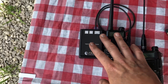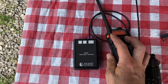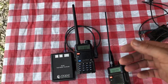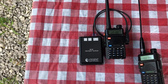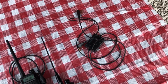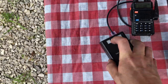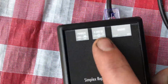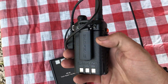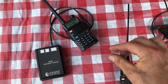Now to power all this — this antenna is coming off, this battery is coming out, and I have two battery replacers. I decided not to do the duplex repeater and just play with it, though it's kind of a pain and somewhat useless for my need. In a SHTF scenario of course it would be awesome to have, so I'm not going to throw it in the trash. I'm going to have a power supply right here that takes four through 28 volts, so it'll be 12 volts. The battery replacers take the battery out and a thing that looks just like a battery slides in, but it has wires coming out that you hook to 12 volts.